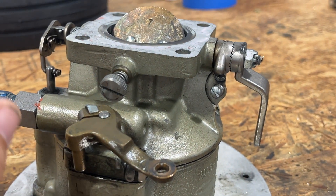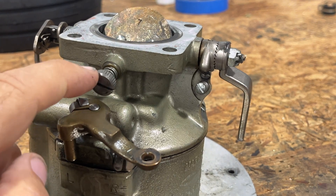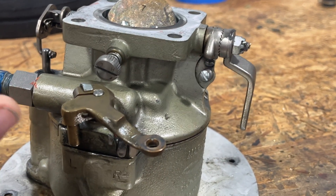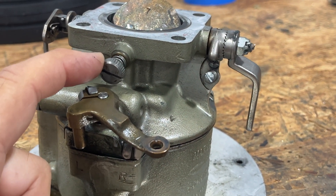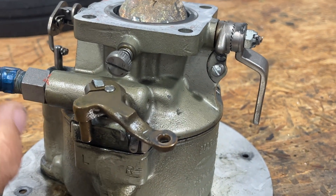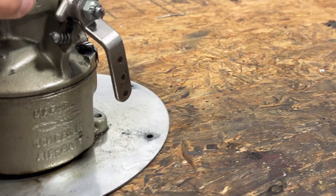Make certain you give yourself enough room — if you're not near sea level you're going to find you're putting that screw in quite a bit, and if you go down to the beach Saturday afternoon it might not idle very well for you. The easy way is just keep it off the idle circuit — a little higher RPM will adjust that for you, so you can just leave it set for your home base best ground idle.